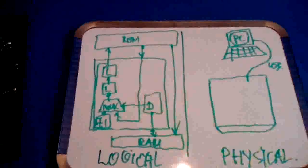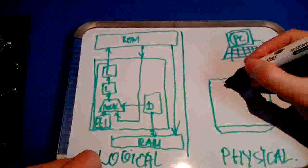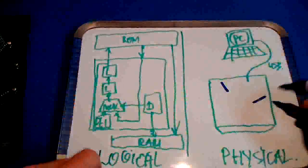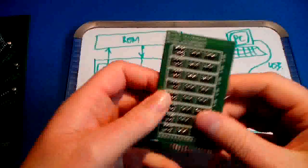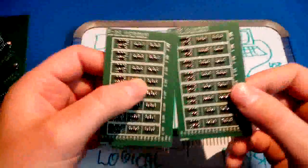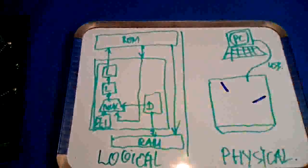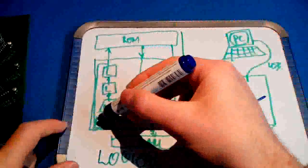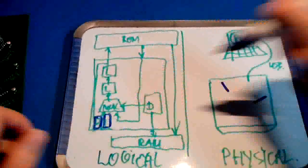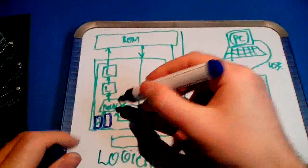So now we go. These two modules are basically sitting there and there, something like that. Alright. These are discussed in another video, but basically each forms an 8-bit increment unit, and together they form a 16-bit increment unit. These are used to increment the program counter. Done. So in the logical model they are sitting here. So this +1 block consists of 2 modules, right? In parallel.